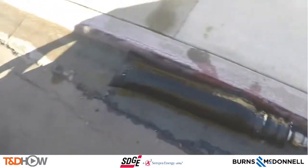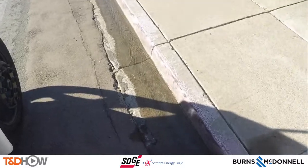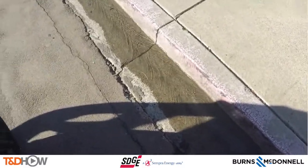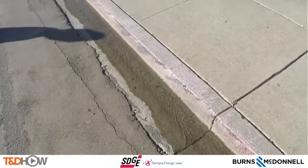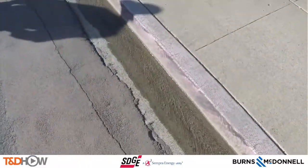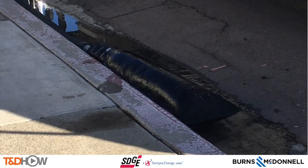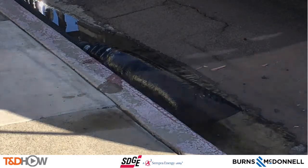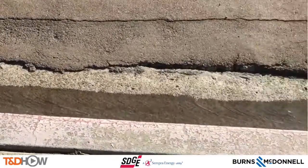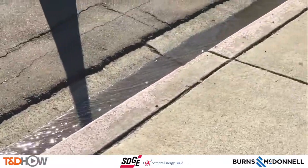At this point I like to check the water, check the filter sock, make sure there are no leaks, make sure there are no particulates getting into our storm drains. This is an effective and efficient way to filter out all the particulates and oils and all the other nasty stuff that is in our manholes, to make sure that the water is clean, clear, and odorless going to our storm drain.